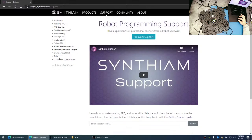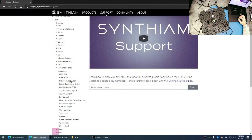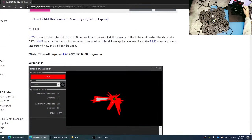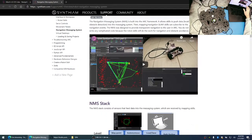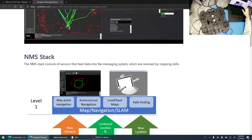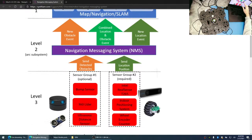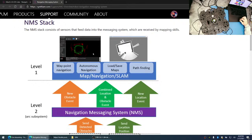If we take a look here under skills, navigation. Yeah, here we go. The LDS. That's what it's called. So this will take the data from the LiDAR and it'll push it into the NMS. And the NMS driver, of course, many of you are familiar with it. It's essentially a communication system within ARC that will allow different types of sensor groups to send their data into the NMS. And then you can have skills that subscribe to the NMS data and do something with it.